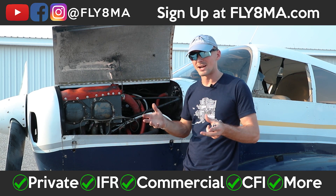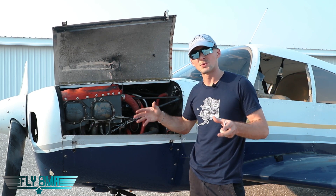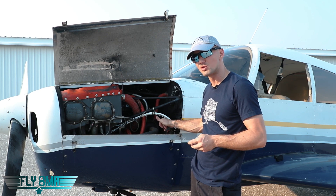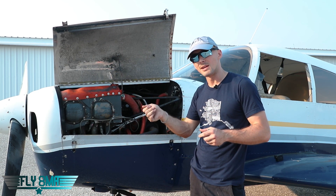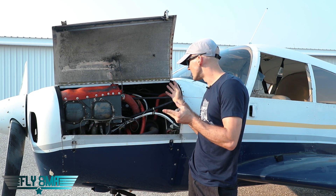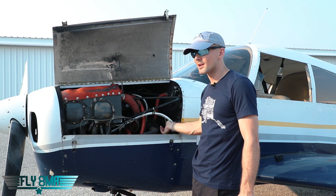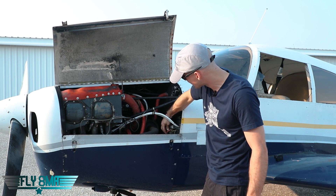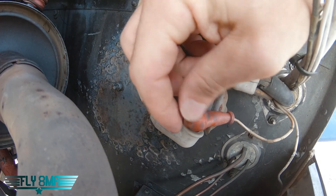Now checking those P-leads is an important thing that you should be doing from time to time — or better yet, every single time, especially if the POH calls for it or if it is on your checklist. And as far as jumping this little relay, we'll talk a lot more about relays in other videos when we get into the electrical system on our Piper Cherokee here. We'll actually cut open this specific relay and show you the inner workings of it — how that switch makes contact, how supplying 12 volts right here actually gives you a closed circuit to supply a lot of power to your starter. There's no need to ever press a button or turn a key; you can make the engine run without all that. And if you're working on your airplane with the master switch on and you bump this with a wrench and close that circuit, that prop's going to turn. Even if it doesn't run, a big piece of aluminum hitting somebody in the forehead really hurts. That's why we have these little rubber boots to cover and protect those circuits, because we don't ever want a piece of wire or metal to fall on top of that and close that circuit accidentally.